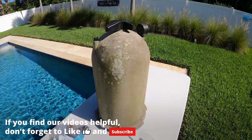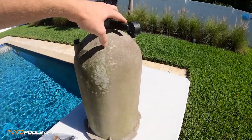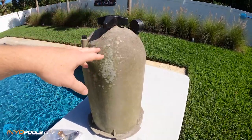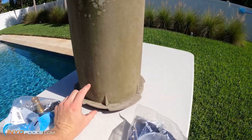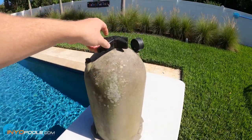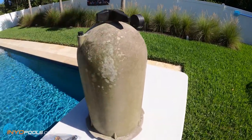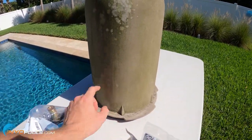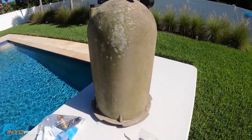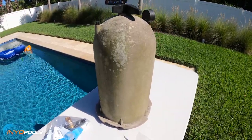This is actually my brother-in-law's filter lid. He called me and said after he cleaned the cartridge and put this lid back on, he kept tightening the knob and it wouldn't tighten up. Other issues might be if you notice that the lid starts to lift off the base — it could be the same kind of issue. The issue is this knob on top has stripped out and needs to be replaced. You want to fix that right away, because if this popped off while your pump was running and you're not home, you could drain the pool or the pump could run dry and you're going to have bigger issues.